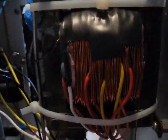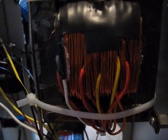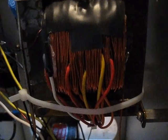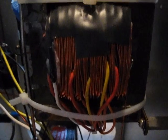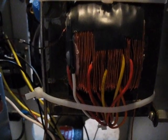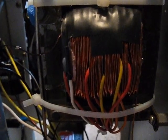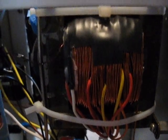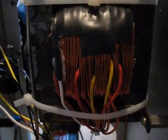The upper one starts at 45 volts and goes to 130 volts AC by 5 volt increments. After 130 volts AC, I added some extra winds and it goes up by a larger amount — from 130 volts it goes to 145, 160, 180, and then finally 200 volts AC.